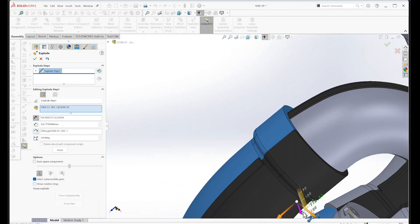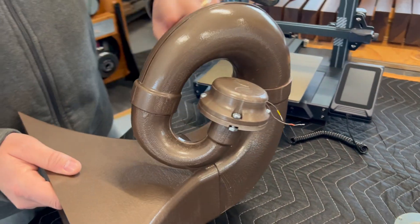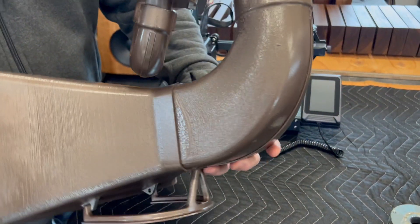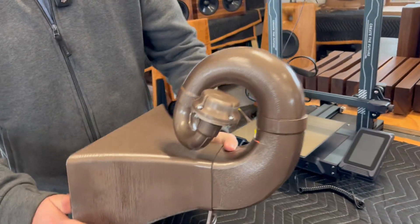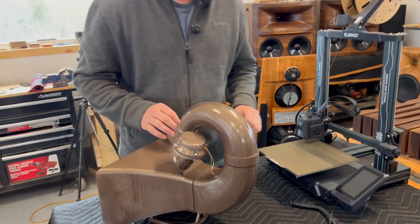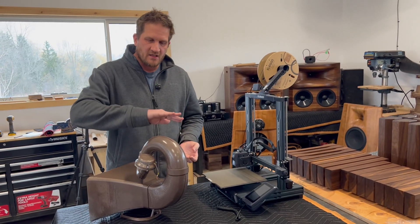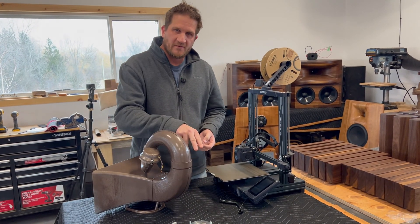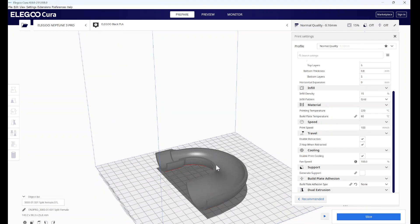That's what I've done for the throat elbow, the middle elbow, and the final elbow before it goes into the mouth. The reason I designed it that way is so that when you're printing it, you can get a clean internal profile — the internal profile is perfectly smooth and you're not left having to tear off supports.